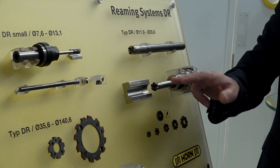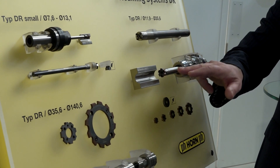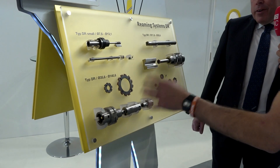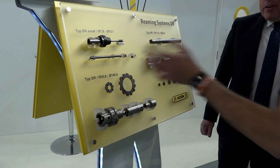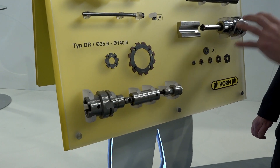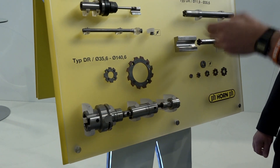Once it's set, just unscrew the inserts, screw another one on, press cycle start, and it's as it was before you had to change it. You've explained that in two minutes — I now understand exactly why you'd want one of these. All you've got to do is put that work in setting the run-out on the chuck, and after that you just change the tip. This is why they're a big hit with setters and operators — they're so easy to use and efficient.